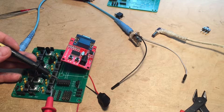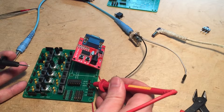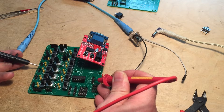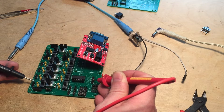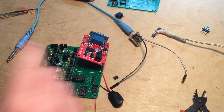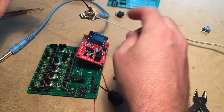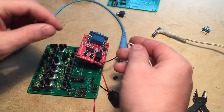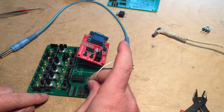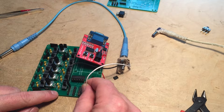You can see if you're troubleshooting, this is where ground should be for the chip. You can also see how sync is set up — the center pin on the sync header is connected to the middle pin, which should be connected to all of the sync bus pins on the other side. So anything connected to this is connected to the center pin. Once you have one of these adapters, you can connect the ground or sleeve to one of your grounds, and whatever the tip is connected to will be connected to an audio source.